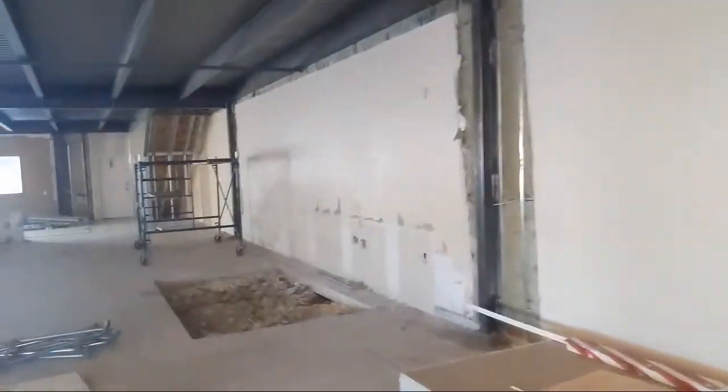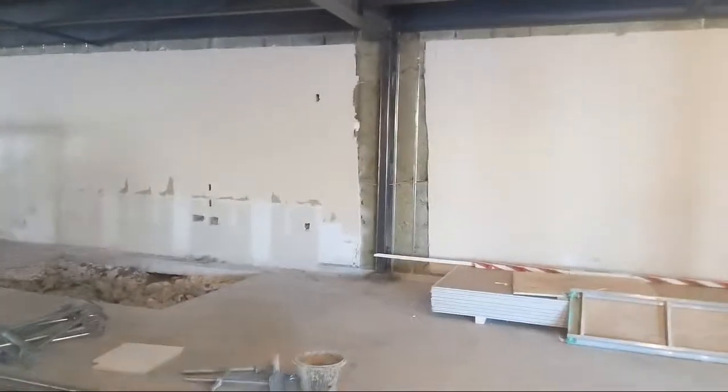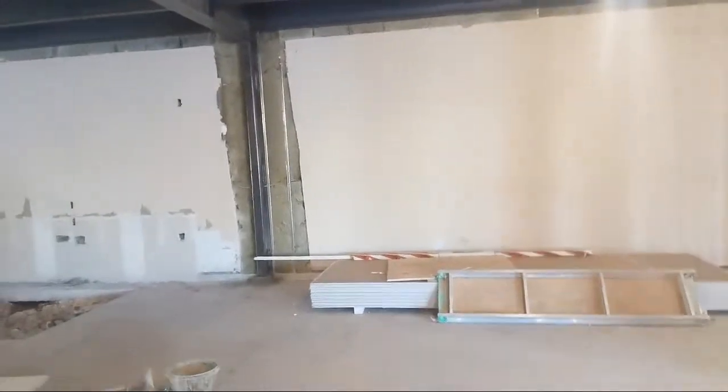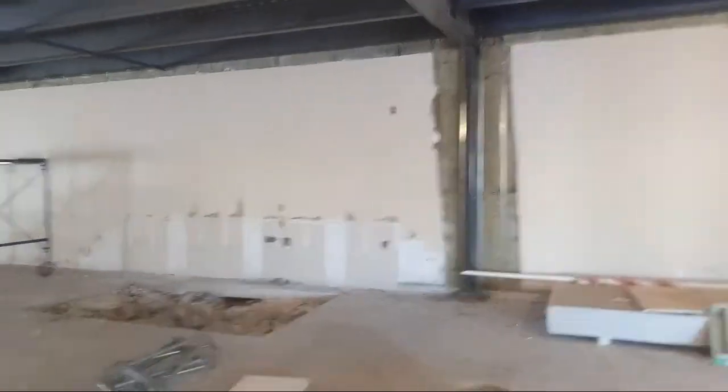Because, like all this little patching and stuff, guys, I'm going to have to take out all of this crap and I'm going to end up having to coat this whole wall. This whole wall will have to get skim coated now. So it's going to cost the owner three times more than if he would have just taken out the drywall, okay? At least three times more. So don't be cheap when you're doing demo, okay? And if you're talking to an owner, just tell them straight up, this is going to cost at least three, four times more than it should have because they didn't take out all the drywall.